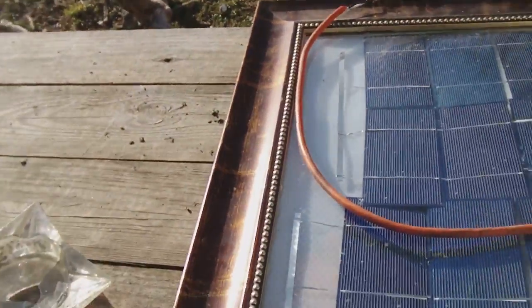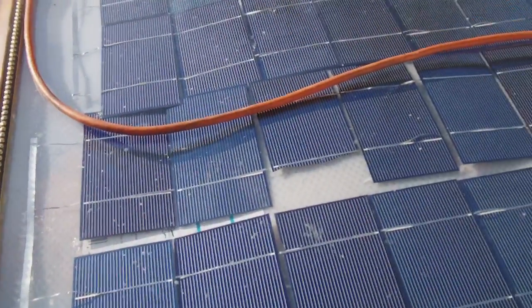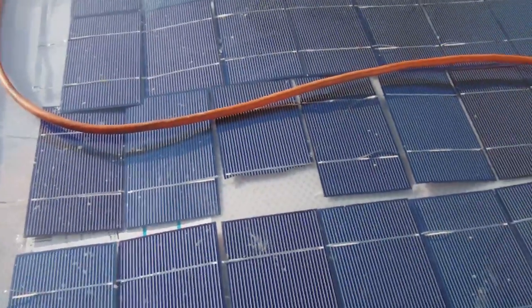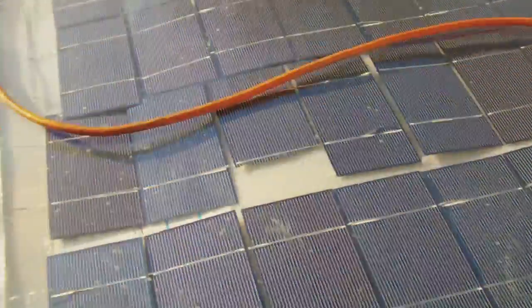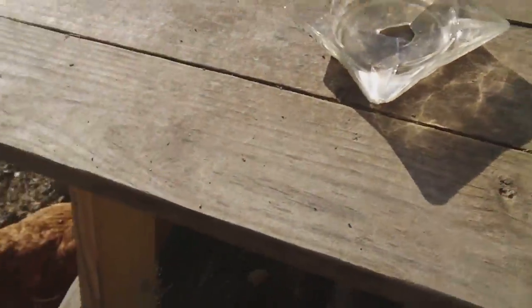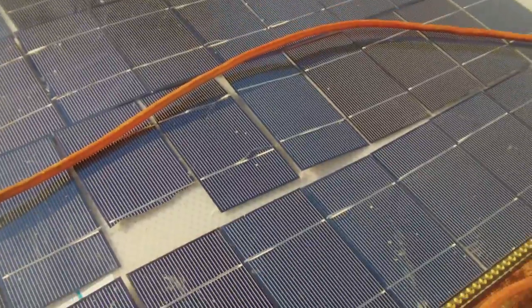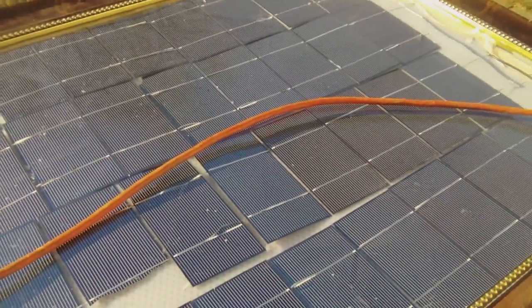What I ended up doing is applying the solder to the iron and then the flux to the contacts, and then just very quickly tapping it to make the solder flow — applying the iron very quickly with the contacts to make the solder go where the flux is onto the contacts.